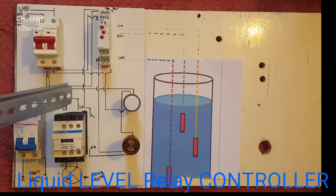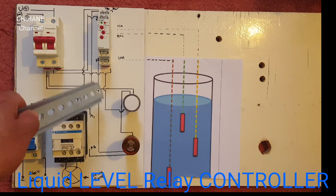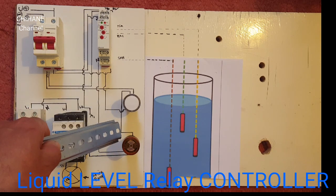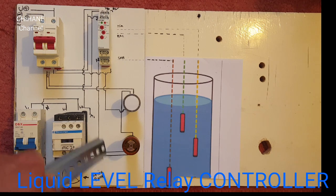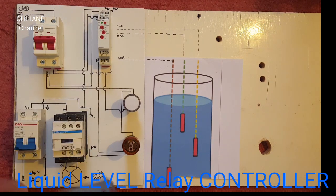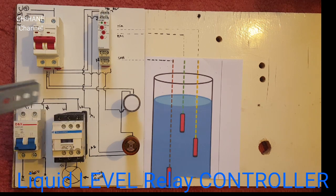So now, we've got these two lights here. The COM goes to the COM on this light, and it gets out from this light — one goes to number 12 on the relay, and one goes to A2 on the contactor. Because we've got this contactor here and the circuit breaker.